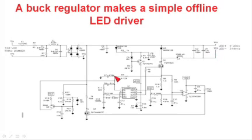One interesting thing you'll note in this design is that there are no electrolytic capacitors. This is very important because that little power supply gets tucked away inside a sealed container with no cooling, and so the temperatures in the LED light bulb can get quite high. In fact, we've measured 125 degrees C in power supplies in some bulbs we took apart. At 125 degrees C, long life is not achievable. Most capacitors only have a rating of 105 degrees C, so it's critical to keep this thing as efficient as possible and to keep the electrolytics out of it.